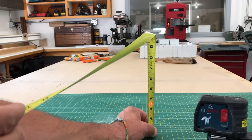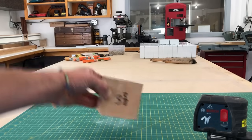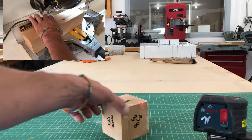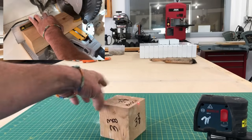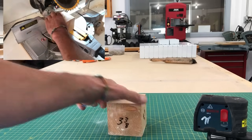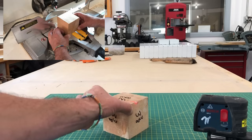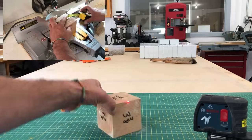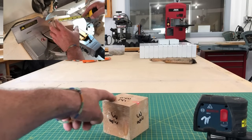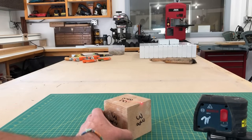You take your measurement for the height of your beam off of a flat surface — in this case three and three-eighths. Quite simply, you cut yourself a wood block that matches those dimensions. I actually cut mine into a cube, so no matter which way you rolled it, you always had the three and three-eighths. Cut from a piece of scrap Douglas fir 4x4 that was laying around, and you trim it so that the beam is right there at your top corner. You can see here how the beam basically splits along the top of the block. This definitely works.